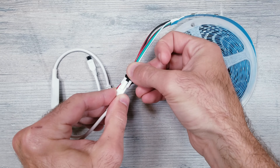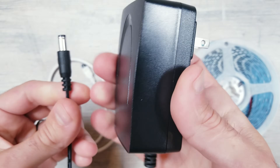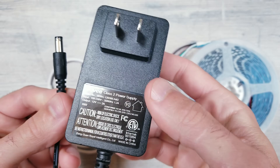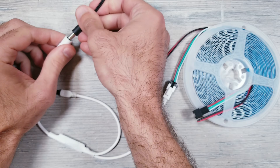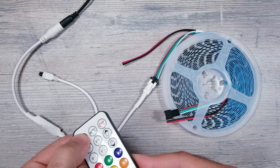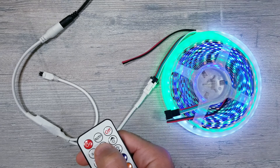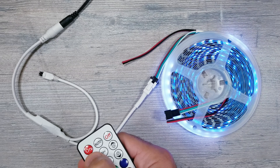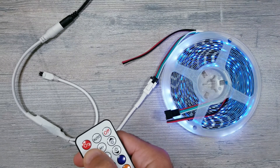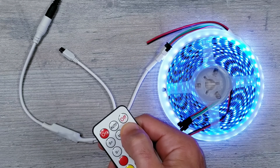Moving on, let's go ahead and get this set up. Take the controller that it came with and plug it into the beginning of the LED strip. Then I'll be using an old 12 volt 3 amp power supply and connecting the barrel plug to the power end of the controller. Next take the physical remote, point it towards the IR receiver, hit the red on button and things should light up. From here you have a bunch of different animations you can cycle through as well as controlling the speed and brightness. The 3 amp supply was enough to power the entire strip at full brightness on white settings with no visible voltage drop.